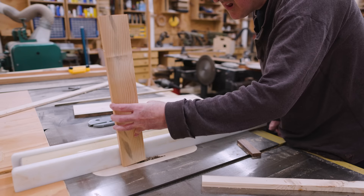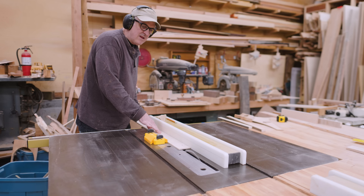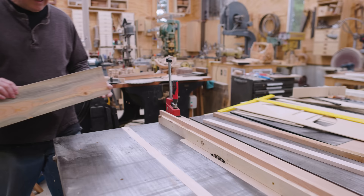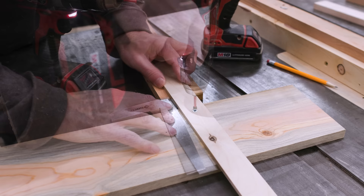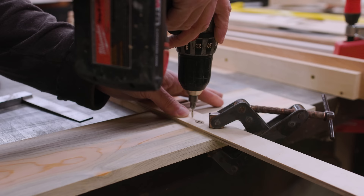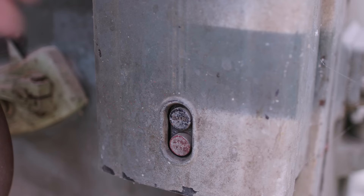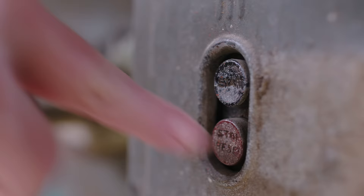Now I want to make the fronts and backs and to make the joint at the corners of the drawers. I wanted to use my Oliver table saw with one of the dado sets, but I don't have a miter gauge for that saw, so I made a quick wooden miter gauge so I could push the pieces through the blade. This saw has a very wide miter slot, so I'm going to put a quarter-inch piece of plywood in the miter slot and then a wide piece of pine as the fence on the miter gauge. It seemed to work and was square on the first try, which was amazing.